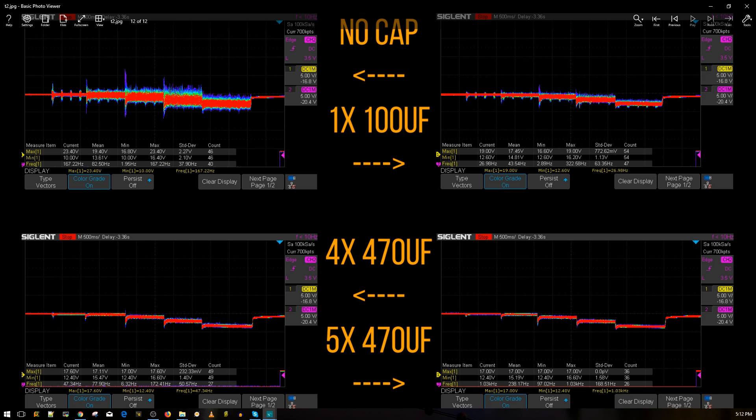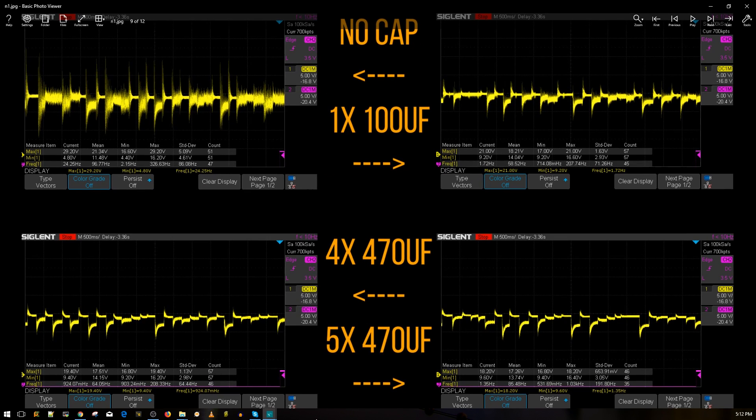Now let's get into the noise — I'm sure everybody was waiting for this. This is aggressive flight maneuvers with this ESC. With no capacitor there's clearly a lot of noise. With the 1000 microfarad low ESR capacitor it did pretty well — a huge difference between no cap and a 1000 microfarad. The 470 was also about the same as the 1000, so you can still get away with 470 microfarad and it'll still make a huge difference for your quadcopter. With four caps the result is super clean — this is the voltage drops from the battery itself. That is a huge night-and-day difference between no cap and four caps.